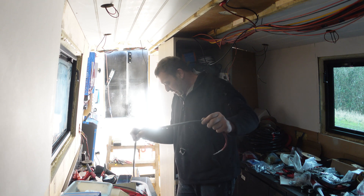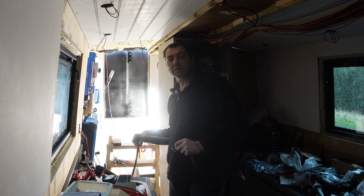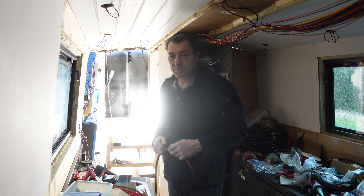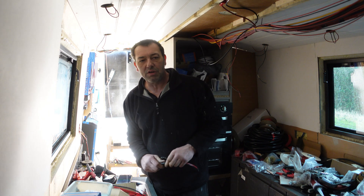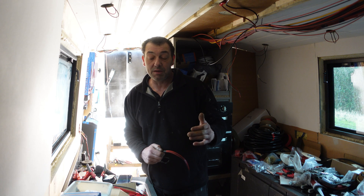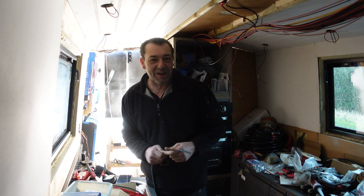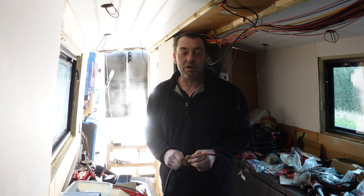It's probably going to be somewhere in the region of 9 metres, but if you take into consideration I've sized my cables for the length, and then to add another 9 metres it was going to drop them — it still would have been alright, but I don't want to drop voltage. The calculator I'm using, I'm trying to keep everything at a reasonable drop. You can have voltage drop whatever you do, unless you spend a million pound on cabling and put some really stupid sized cables — you can have voltage drop, simple as.